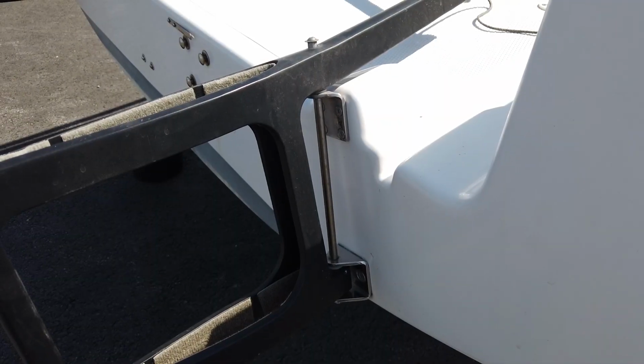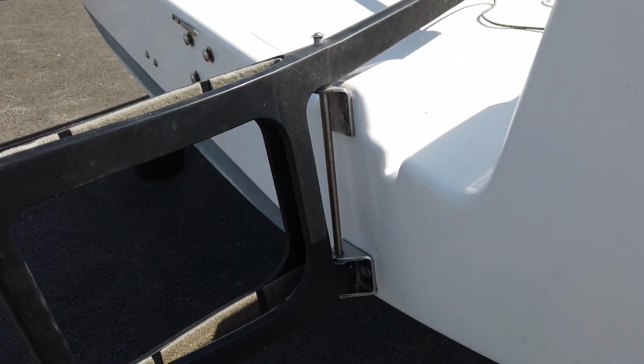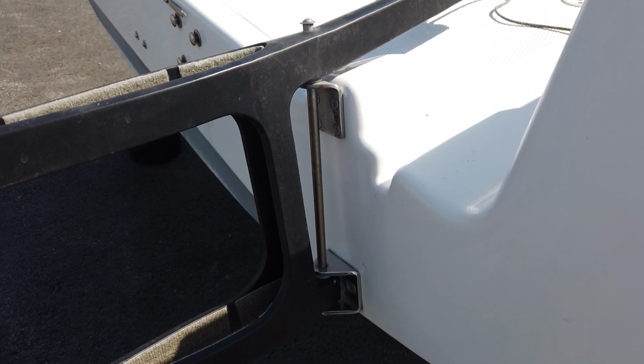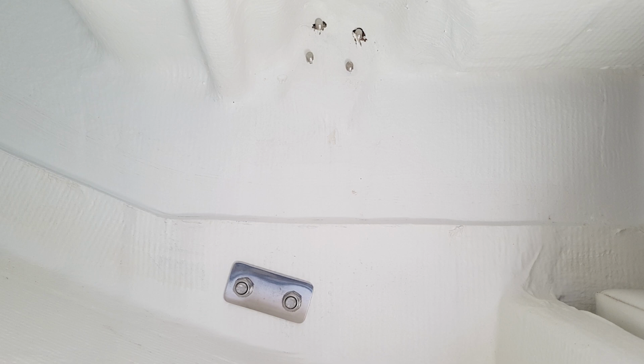Another crucial component of every sailing boat is the steering system, so let's go through the key checkpoints. First, check that the boat rudder hinges are completely tight and without any movements. That's easiest done from the inside. Look if there are any stains of rusty water on the inside of the storage locker under the cockpit. If you find that any of the hinges, especially the bottom ones which are very close to the waterline, are not tight anymore, completely remove it, clean the old sealant and reseal it.